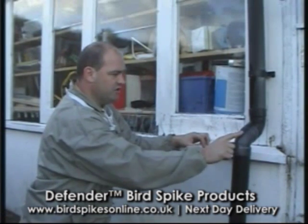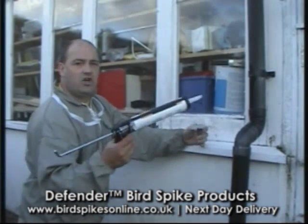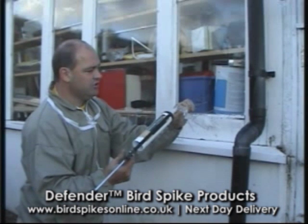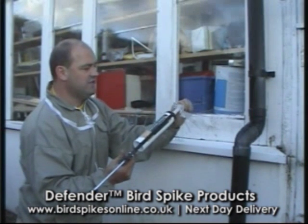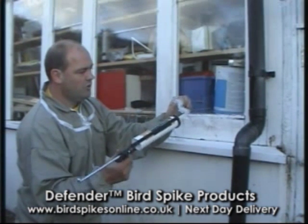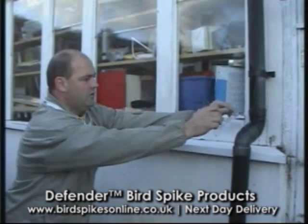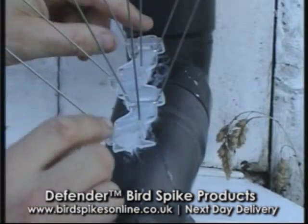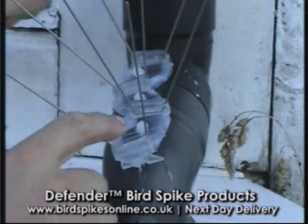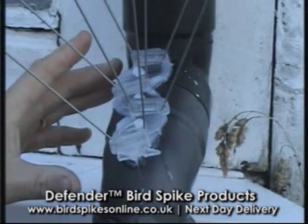So I'll put the piece on the pipe work first of all. We take the caulking gun, we just squeeze the trigger gently, and then you can see the glue coming out of the end. And I'm just going to put that like a big tube of toothpaste, to squeeze the toothpaste right along the bottom. To release the pressure, I just click my thumb on there. Now that will press down onto the pipe. And then you'll notice as I press down here, you can just see oozing up through the holes the little spikes of glue. And that will just help lock it into position. Now that's absolutely perfect like that.